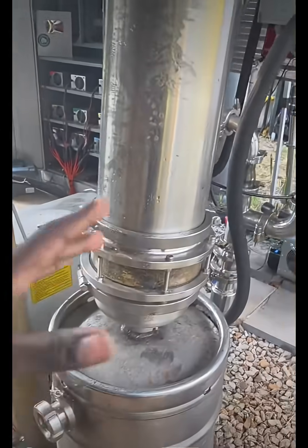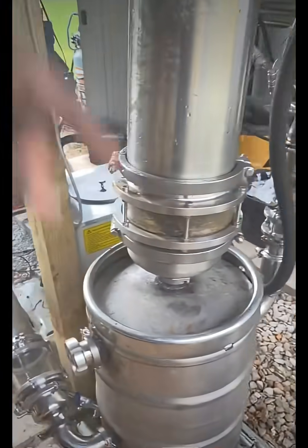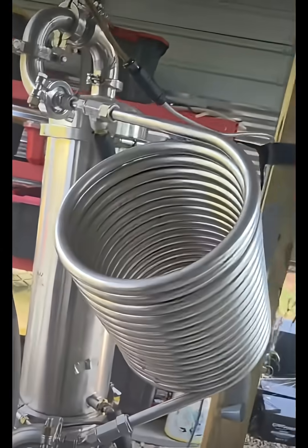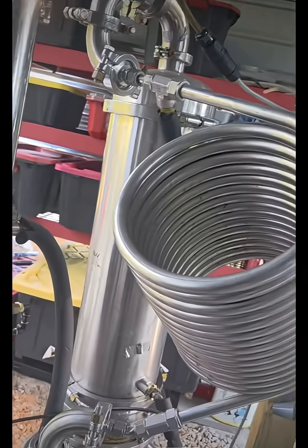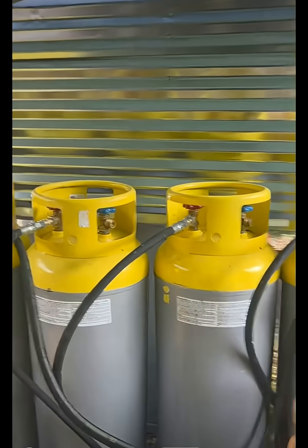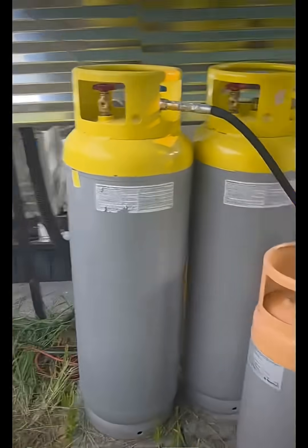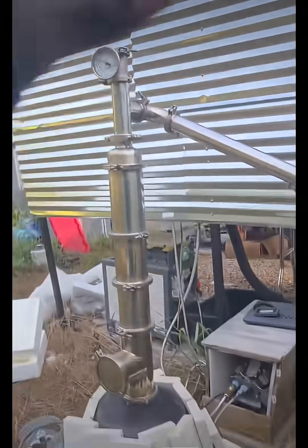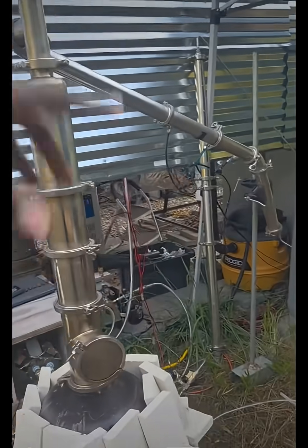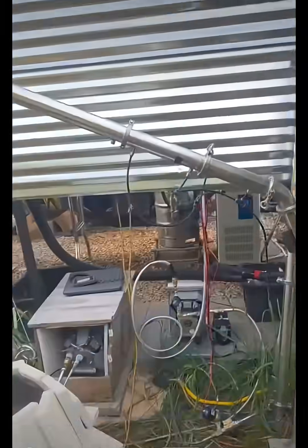That petroleum vapor is no longer plastic — it undergoes a permanent chemical change called pyrolysis, where it is returned into essentially crude oil. Some of these vapors are permanent and will never turn to liquid again; those are natural gas. That high-pressure plastic-made natural gas goes into all these tanks, which I can then use to run my refiner, which will refine that plastic crude oil into plastoline, plastidiesel, and plastic kerosene.